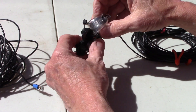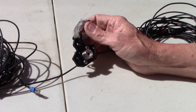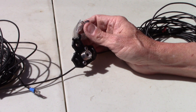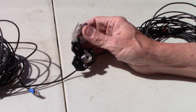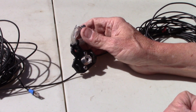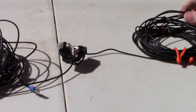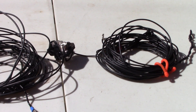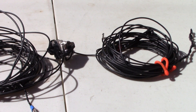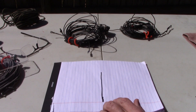I made a clamp and put some material around it to protect the pole and just slip this over the pole, attach my coax. I even use RG8X — that's a little heavy for these poles, but this pole will take it if it's not a super windy day. Hook your coax up, raise the pole up, and you're in business. Tie off your ends in an inverted V pattern and you've got a great antenna up at 40 foot.